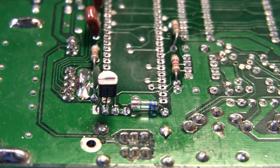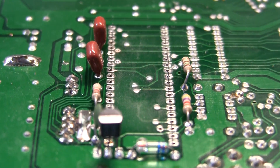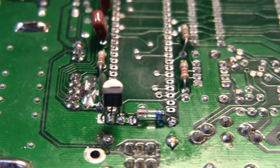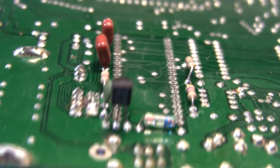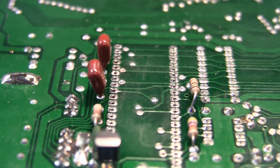You may have to bend the pins outward just a little bit to get them all in alignment and get them started, but they will go through if you're patient and careful. Now I'm ready to solder these into place and give it a try.